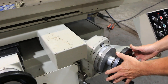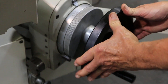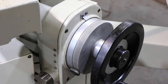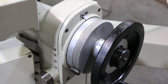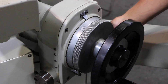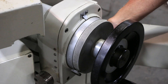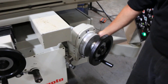There's a safety switch mounted in this handwheel. You want to pull this out when you're going to do the rapid up and down. But in regular grinding, you could leave it out so you can't bump against it. So this will continue to feed each time the saddle reverses. The amount that it's feeding is adjustable by the adjustment on the side of the vertical feed housing here — you can turn that in to get less of an increment and open it up to get more.